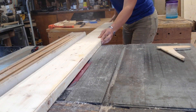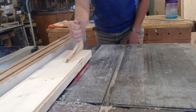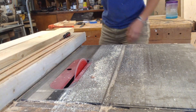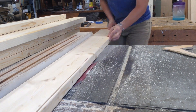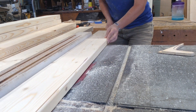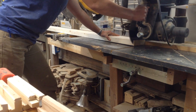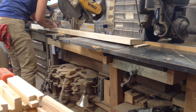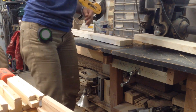To start this off, this is very similar to how I build built-ins — just different size cabinets. I'm going to be ripping down some two-by-sixes. The base is going to be five inches, so I chose two-by-sixes which are five and a half inches wide — I'll rip off both sides so I have two nice square edges. This is just the cheapest white wood I could find. The base is important because it gives an attachment point for the baseboard and a way to level the built-in. The back base is about 101 inches and I made it in two sections, and each wing is about three feet wide.